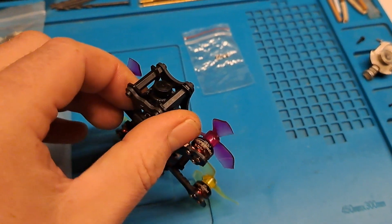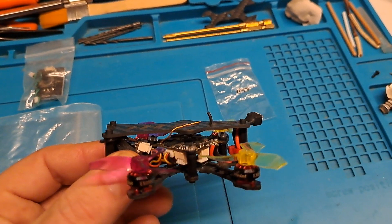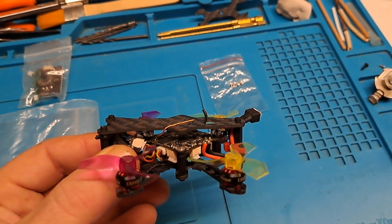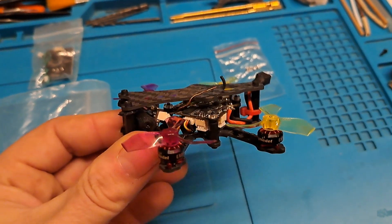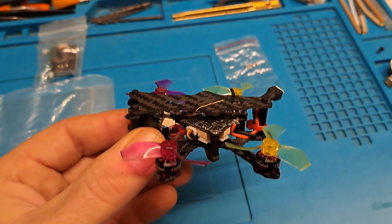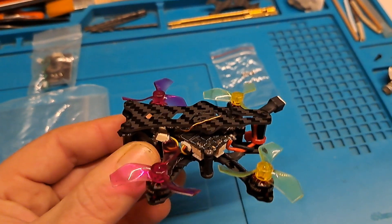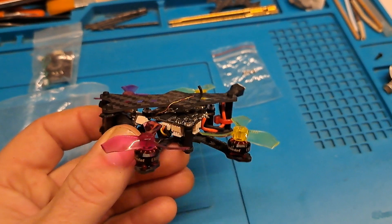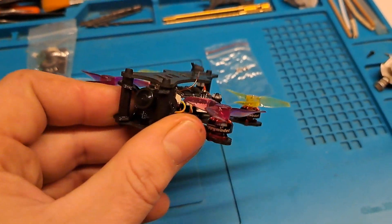The camera is not super tight and can move around, but it's stuck up against the front post with the plug. I'd probably advise getting a camera with no plug for this build - one that solders directly at the camera - and then a plug to connect to the flight controller. Or go with the Diamond VTX and you can mount the ant camera.